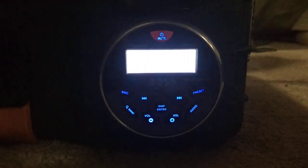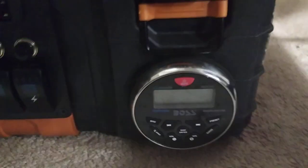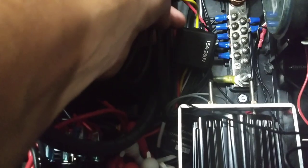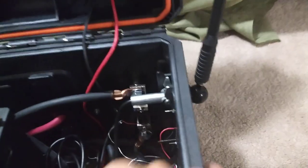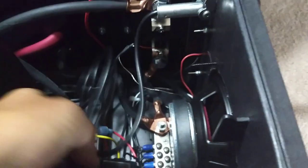The radio is great — it gives you weather band, USB capability for a thumb drive, Bluetooth or auxiliary input, so a lot of capability. The installation is straightforward: it comes off a switch just like every other device. It also needs a constant power for memory, so that goes straight to the bus bar. Just follow the instructions that come with the radio — switch power, constant power, and ground. This particular radio has a built-in fuse box, so fuse protection is already there. You have to have constant power, otherwise you'll lose all your settings. For AM/FM capability, I added a rubber ducky marine-style flexible antenna, which has some adjustability built into the base.